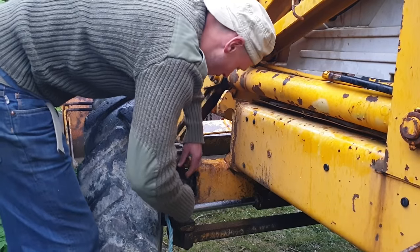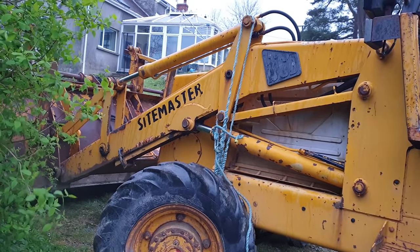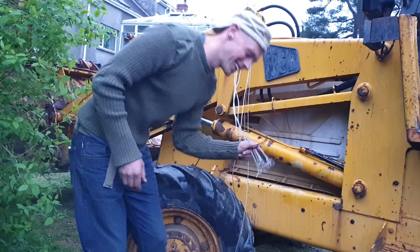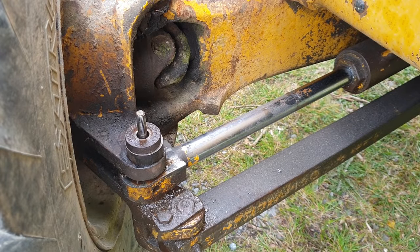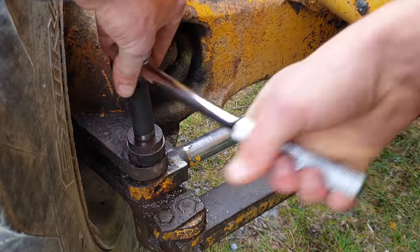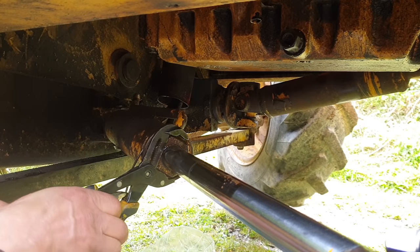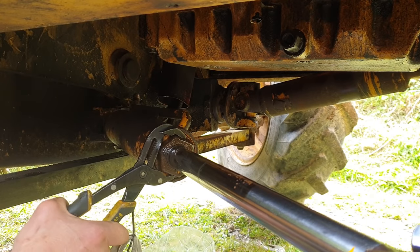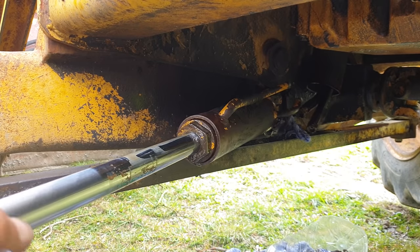Now I'm going to try and use the digger's power itself. Various combos of fire, penetrating oil, levers, sledge hammers and even three strands of steel rope later, we were finally rewarded with this method of drilling and tapping the pin and then using a nut to push it out. After that little saga, the cap of the cylinder was relatively easy, once of course we worked out it was affixed with wire and not all threaded.